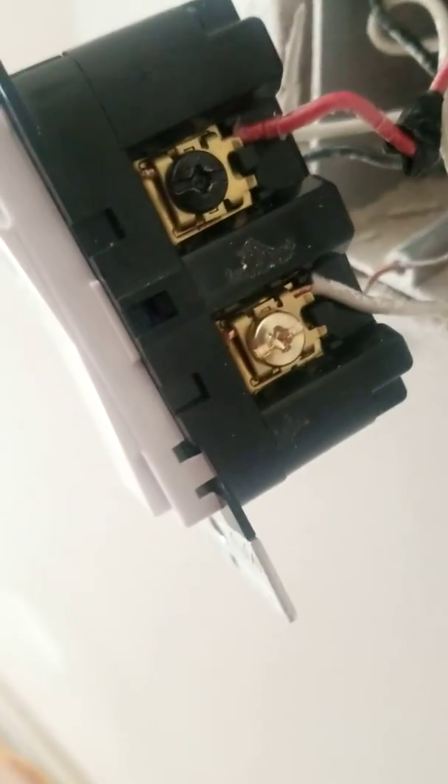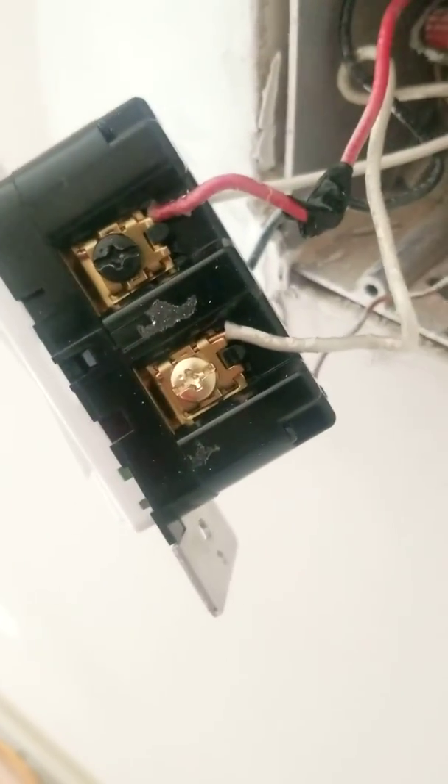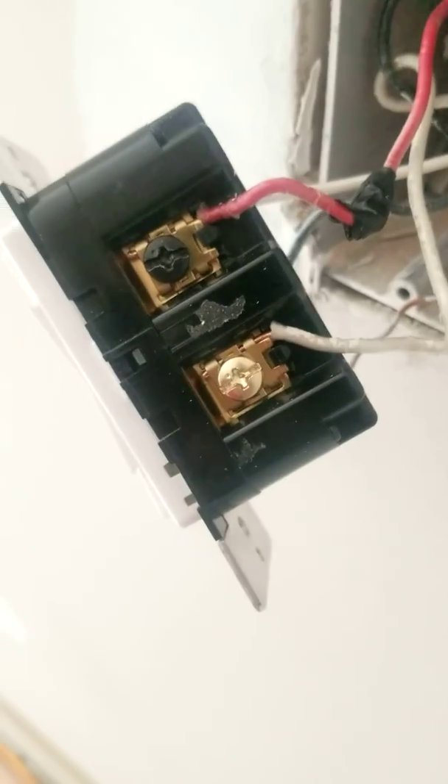The remote has to be wired at the line-in. I promise you it matters. Here's why: the traveler wire, which is right underneath the BK and is labeled yellow and red or YL-RD — that traveler wire is very vital and has to be connected to the same location on the remote.